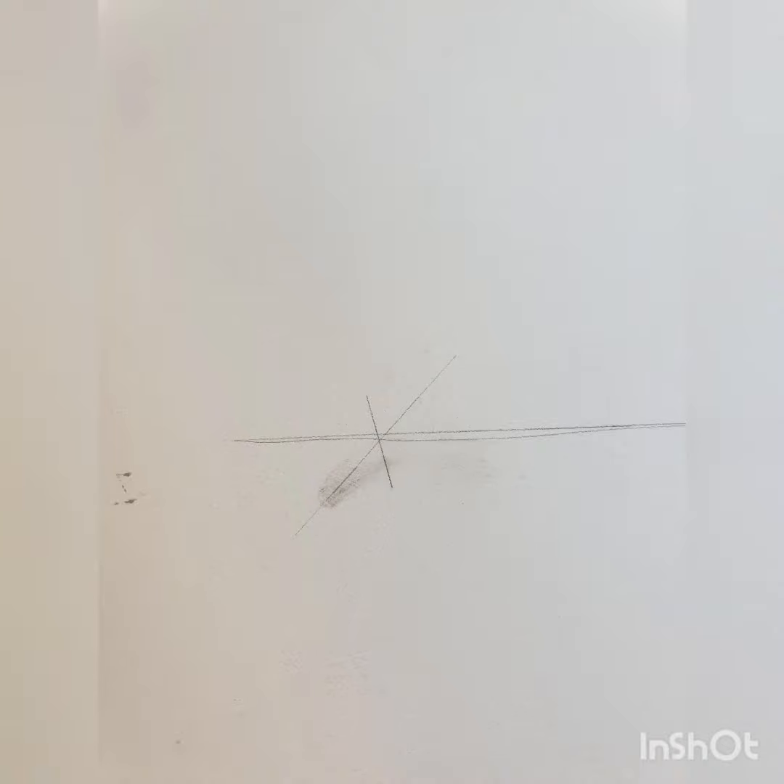I did this three times in total, each spaced out pretty evenly — approximately 120 degrees — using the straight edge of my spirit level. I separately lined up each of my two marks and, one at a time, marked a line towards the centre of the table top.